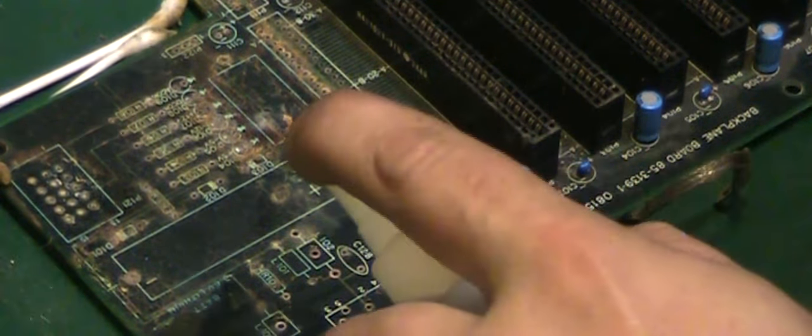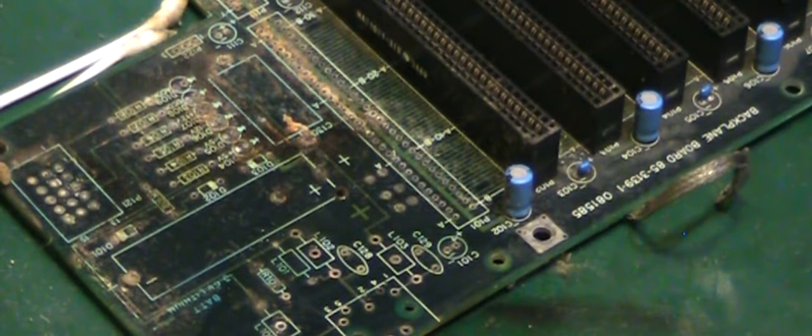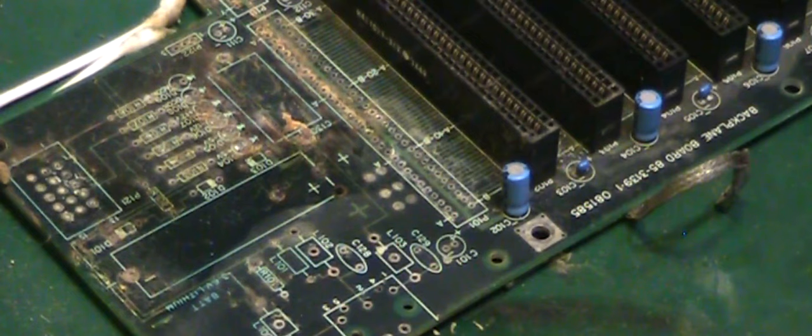Right. Just to give a quick idea what it can actually do. And again, it would take a tiny little bit of IPA, and wipe, in fact I've got a piece of cloth here, and wipe over that bit of board. There we go. We're pretty much back to how it should look there. So I will carry on, I'll do the rest of the board like that, and then we'll come back and we'll have an inspection and see what it looks like. So back in a sec.